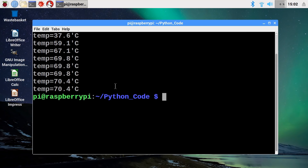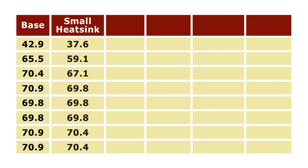The test has completed. Putting those results onto our table, we can see that applying the small heatsink did reduce the idle temperature a little at the start and it heated up a bit more slowly, but it still reached around 70 degrees where the Pi was reducing its clock speed down to 1.2 gigahertz. But of course this is only the start of our extreme cooling tests.